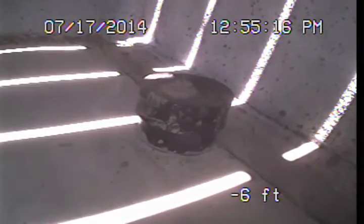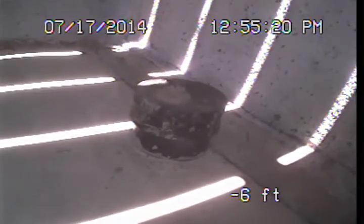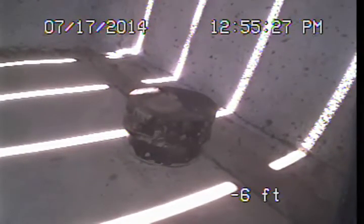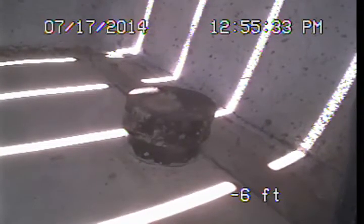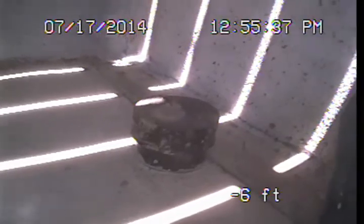We were out here back on June 18th and had some situations with root intrusions in plastic pipes and areas that couldn't be seen. We recommended some sort of better clean-out access be installed, and that it would be a good idea to replace some of the older cast iron piping from under the house out underneath this concrete area below the stairwell.